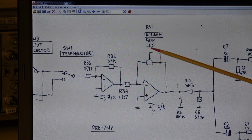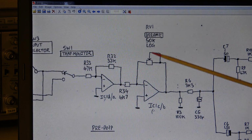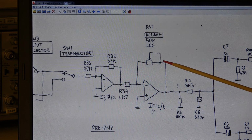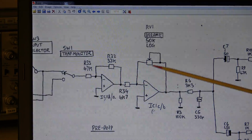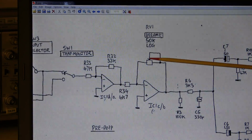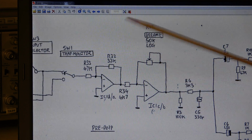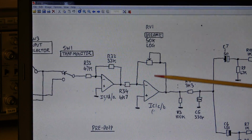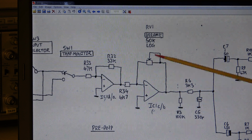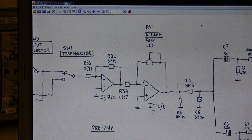And when we have a contact problem here, then the feedback jumps. The feedback is going down to zero, nearly no feedback, only the complete resistor is in, and this means increasing gain. A bad contact here on the wiper means the gain increases. And that's what we have seen in one channel, that the pot is obviously dirty. I hope it's not damaged. It's only dirty, I can clean it. This means increasing output up to maximum. We have seen the amplitude sometimes jump to the maximum possible output.